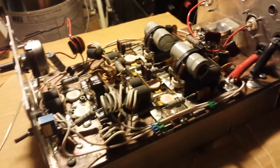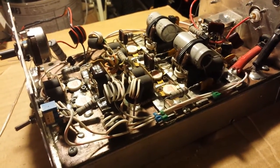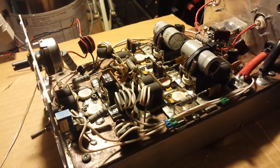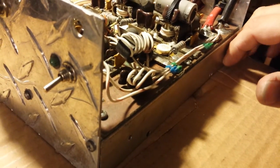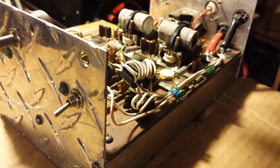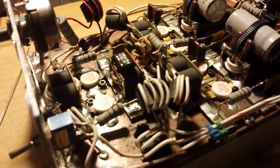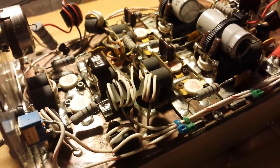There were a couple things of the design I didn't agree with. The way the enclosure is designed, it has a 120mm fan hole and only had like a 60mm fan in it. The fan on top is not cooling the heatsink — the heatsink is actually on the outside of the amplifier. So the fan on top of the case, on the lid there, is only cooling the components. You don't have anything cooling the heatsink. That may be one of the reasons why the driver section blew. There needs to be a fan installed on the heatsink, no doubt, being a 2x4.